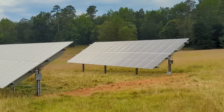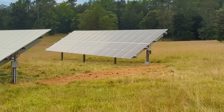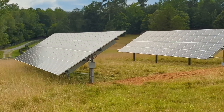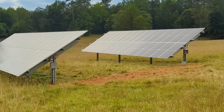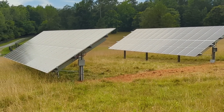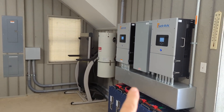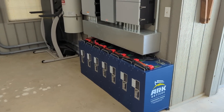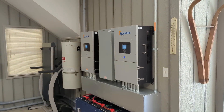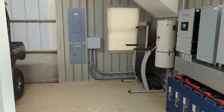We've doubled the solar, doubled the inverter, and more than doubled the battery. So we should be able to wrap it up. You can do it in two days if you kill yourself, or three days if you don't kill yourself or your employees. We've upgraded from a single Solark with three batteries and 15 kilowatts to now having 35 kilowatts of storage with the Arc Lithiums and two 12Ks. We put in a 200 amp bypass, upgrading everything to 200 amp, with a 200 amp fusible disconnect on the outside.